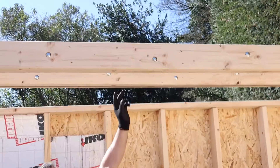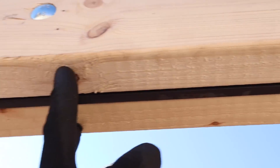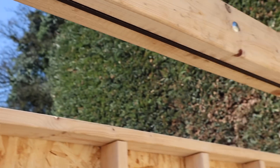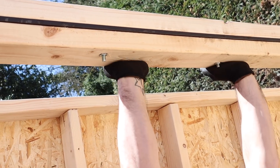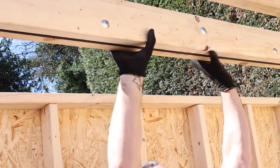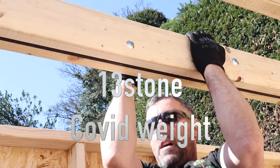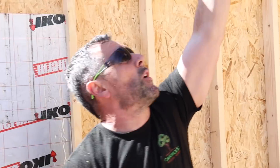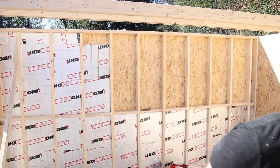What we're creating is flitch beams. Basically, a flitch beam is a piece of steel plate sandwiched between two timbers and bolted. You can see the sag in it one way, but when it's the other way that's where the strength is — it won't flex. So we're going to drop a flitch beam in, a double timber bolted beam, then another flitch beam, and so on.